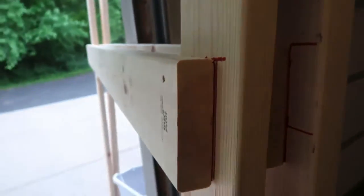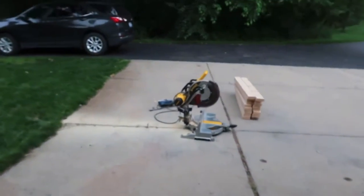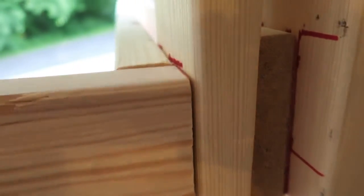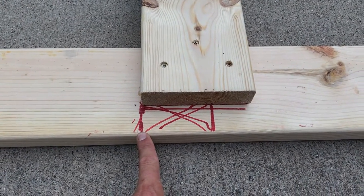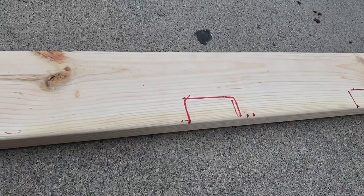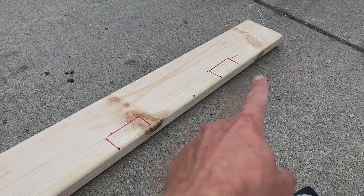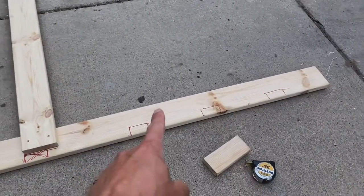I brought the legs and rails down here because I'm not cutting upstairs on the new carpet. You're going to need a jigsaw because the two-by-four is going to be laid in on the two-by-six. Take your excess two-by-four that you cut, trace it, then cut it out with a jigsaw. The top inlay is 58.5 inches. At 55 inches, you take 55 divided by 4, which gives you 13 and three-quarters — so notches at 13¾, 13¾, 13¾, which all matches up with the ladder spacing.